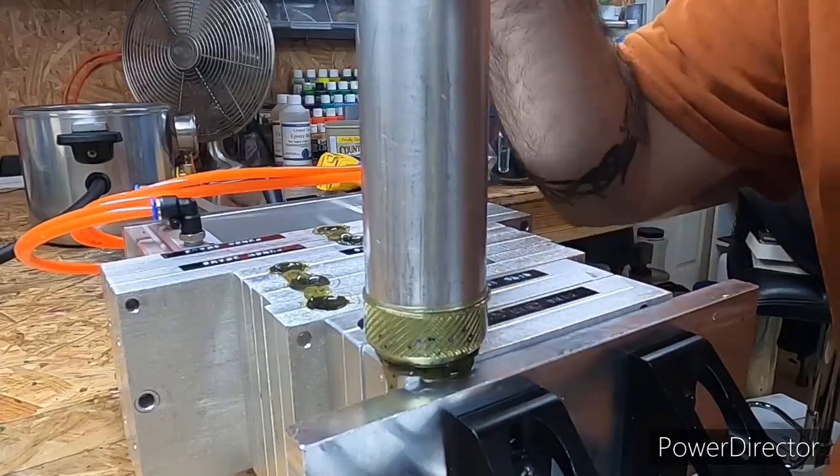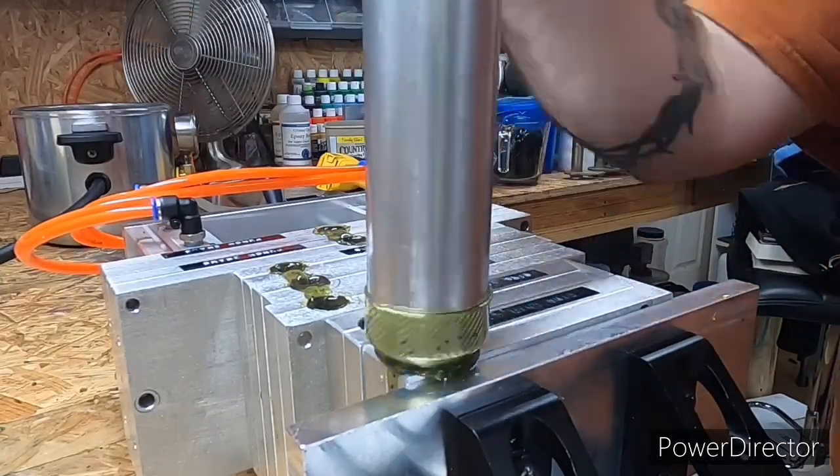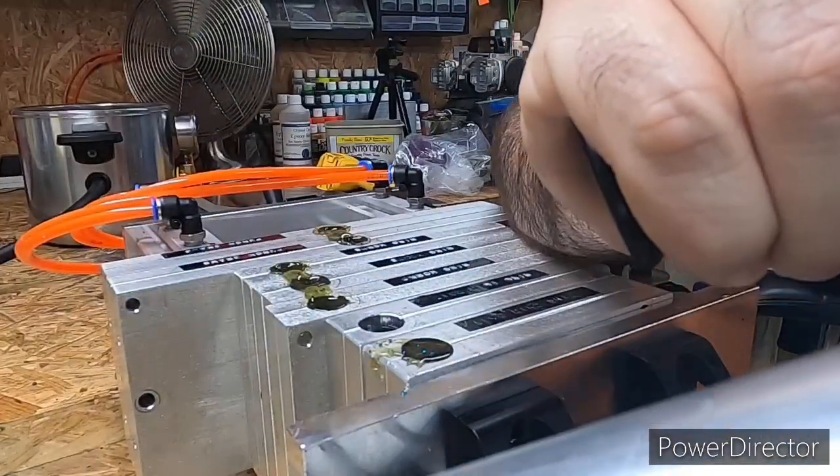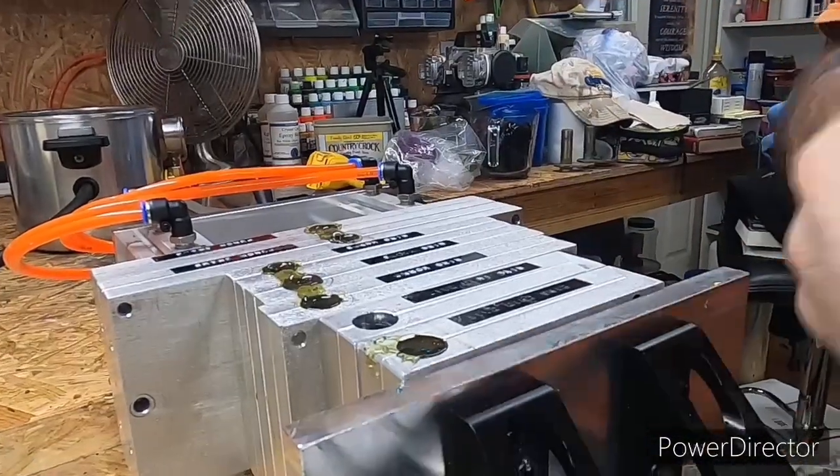And with this mold, this ring swim bait, you get your best results if you can shoot it slow. Sometimes, especially once you get started going, you get all them sprues good. Sometimes you'll get wound up and be wanting to just shoot the hell out of them. But you will get better results with it if you shoot it slow. Like right there, I probably should have slowed down a little bit more, but it should be fine.